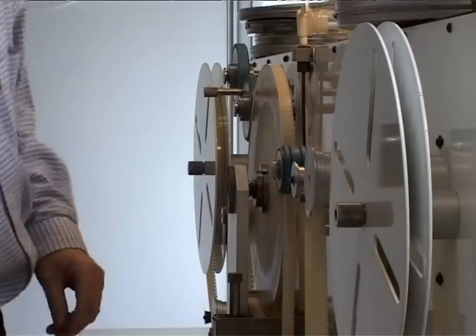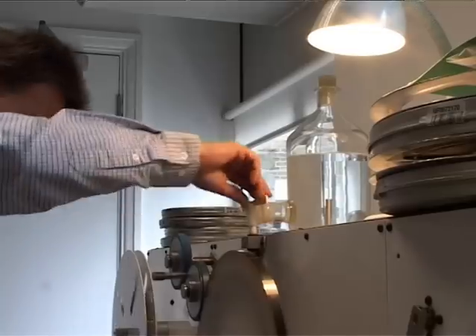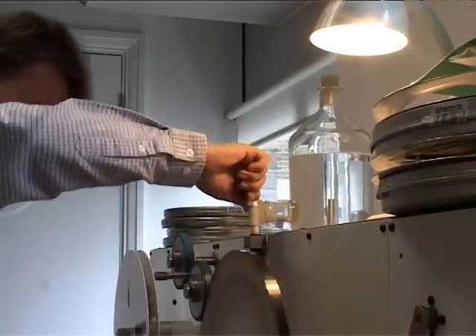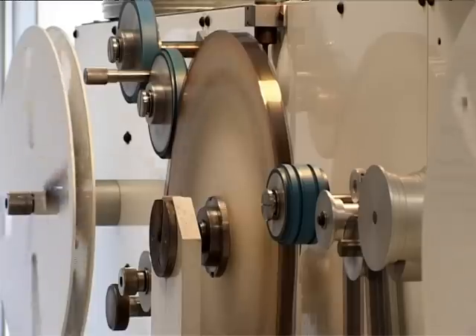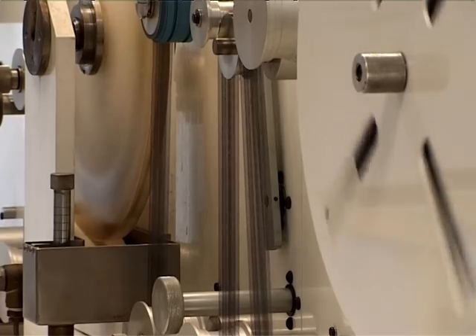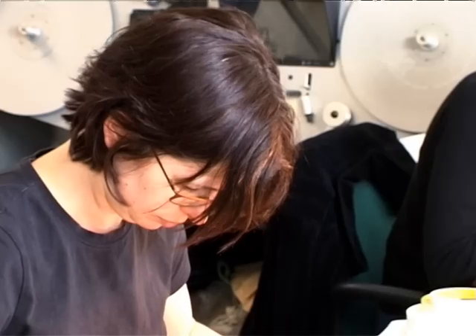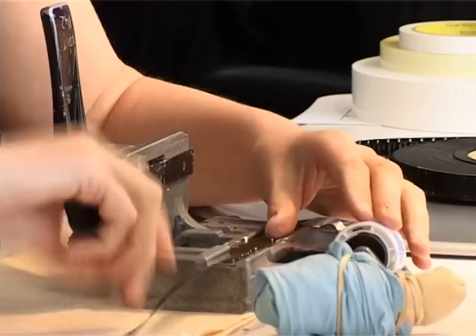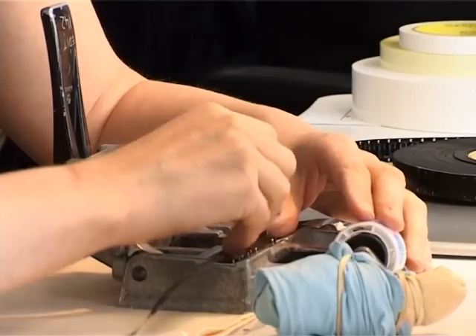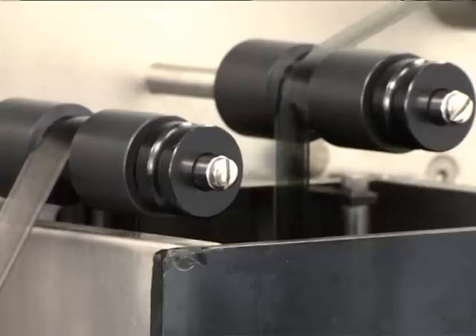For film polishing, the film is run over a glass wheel and any base scratches are filled in with acetone, which re-contours the sharp edges of the scratches, rendering them invisible during projection, scanning or printing. Constant speed must be maintained at all times for this application to be successful. Then if necessary the film is re-joined back to its original geometry. Finally, the film is ultrasonically cleaned again to remove any dirt or dust built up during this process.